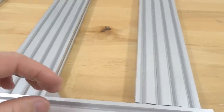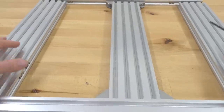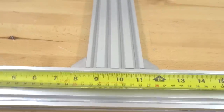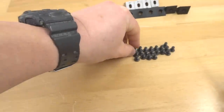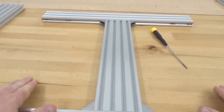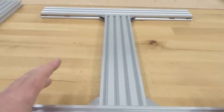We have one locked into place — go ahead and do the opposite end. If need be, use your magnetized screwdriver to manipulate the T-nut. This side is now mounted to our 20 by 60 rail; we're going to do the same to the opposite end. Rotate the system, measure again to make sure we are square — perfect at 250. Taking your magnetized screwdriver, move the T-nuts into place and mount with an 8 millimeter screw. It's starting to come together. Let's move on to our next two 20 by 80 rails, making sure our three M5 T-nuts are on the right side for the right side of the base assembly and our two are on the left side.